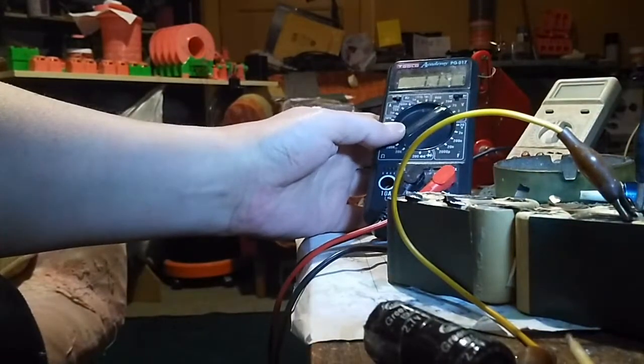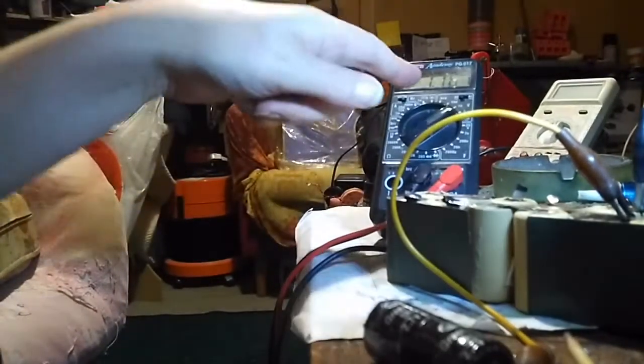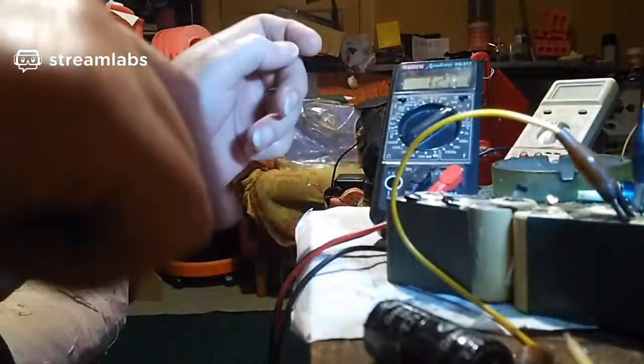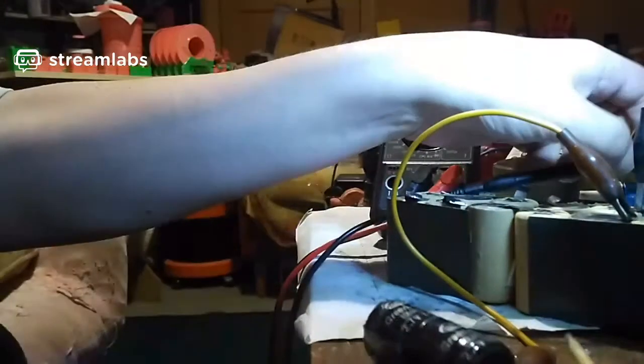I've had this problem before. That seems to be better. Anyway, 1.16. Oh, the voltage is going up. That's because the nickel metal hydrides are bouncing back. Right, let's just measure the voltage across the supercapacitor. Right, so let's just put this on here. Oh, the supercapacitor has now got 1.33 volts in it. It's dropping though. So I don't know what they were using before, but there's obviously some damage done to the supercapacitor, because it's not very efficient now, but the voltage is slowly dropping.